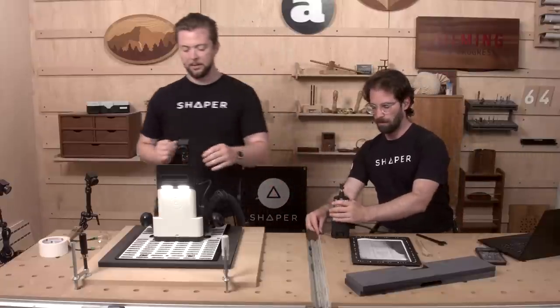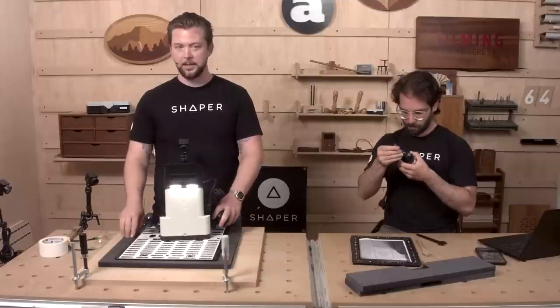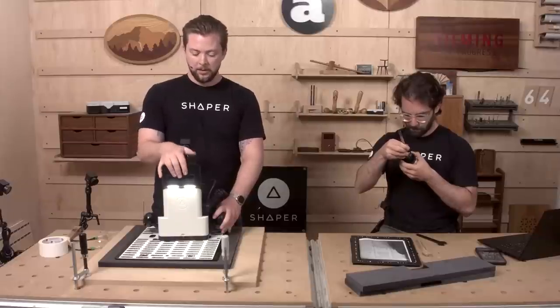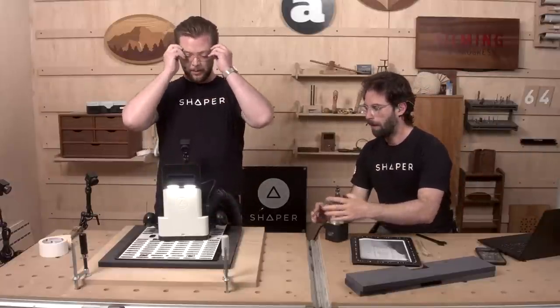You check that out. I'm going to do this in two passes. Now, I'm working on MDF right now. It's pigmented MDF, so it's a cool black color. With the 16mm clearing cutter, still going to do that in two passes. Oh, I think you're right about 17. Okay. Yeah, I think you're right about 17. Two passes, final depth of 17.